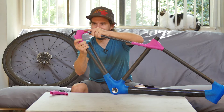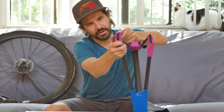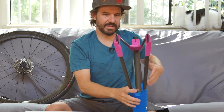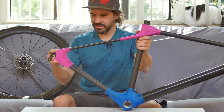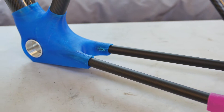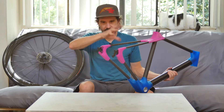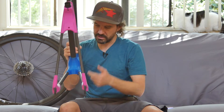I can slide my bottom bracket into place here. The seat tube and the down tube are both cut with the radius of the bottom bracket, so those tubes will sit right against that face. That'll get bonded in, and then these tubes will all sort of interlock. Looks great — can't wait to get the bottom bracket threaded in. It's quite tricky to fit — you kind of just have to bend it open — and quite difficult to assemble when you've got epoxy on here, but we'll figure it out.